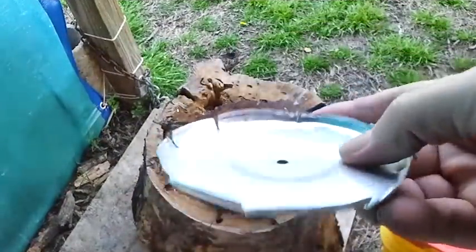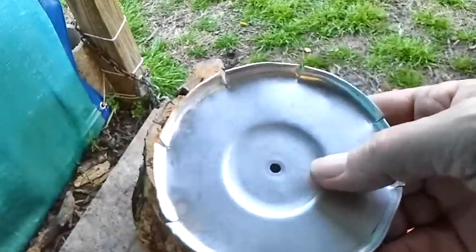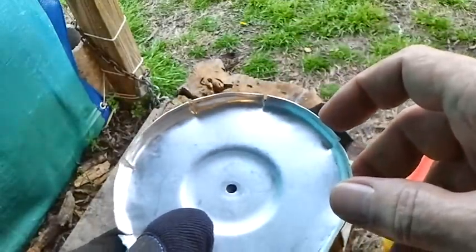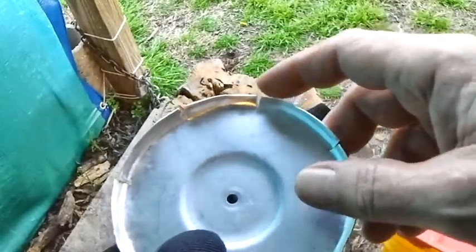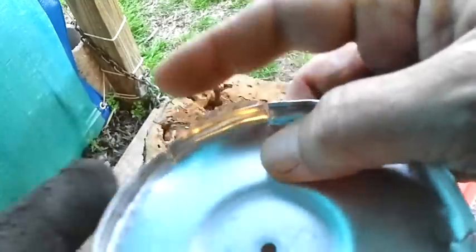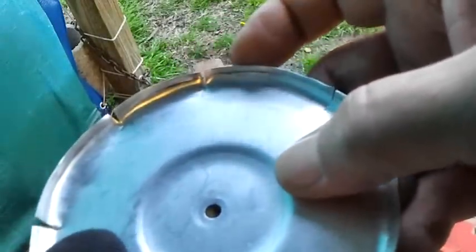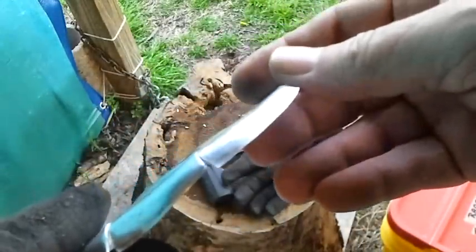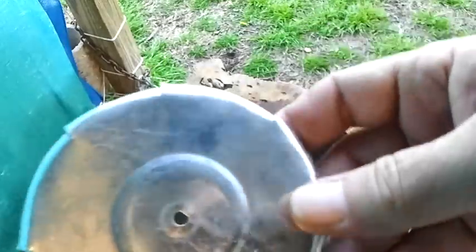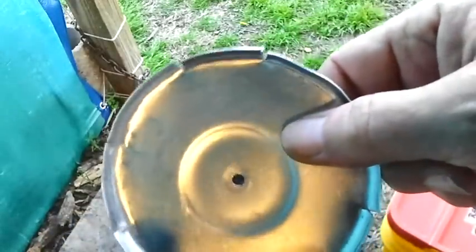Well, I've been working on it. I've gotten it this far and as you see I've cut it about eight times around through there. What I was finding out is as I was bending this up, it would warp around back over here — I was pushing metal from one place to another and making it go flat. So I had to create these little stress cuts, what I call stress cuts, to give the metal room to expand or fold up into that area. I only cut it maybe a sixteenth of an inch, and as you can see I cut it on a V. It's starting to take shape. I just need to smooth it back out, bend it some more, and make a few more cuts, because the first cut wasn't big enough.